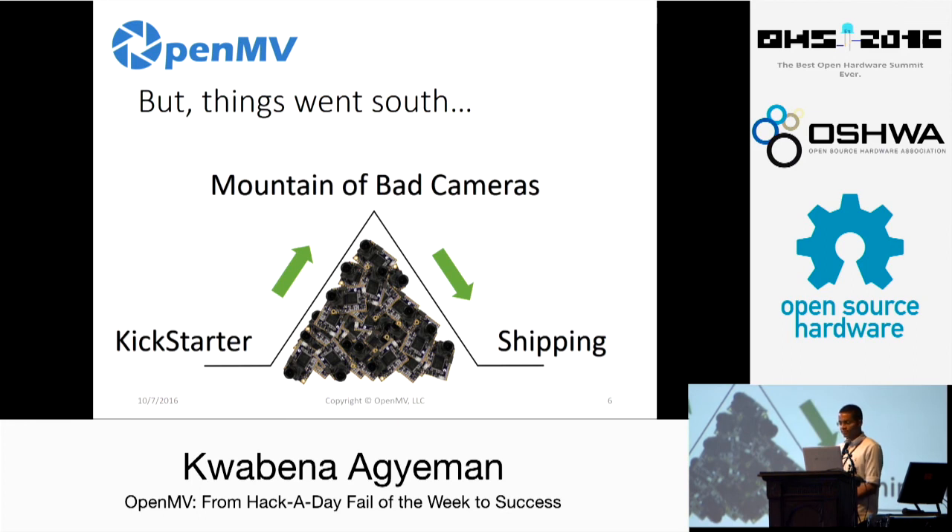But this story is about overcoming failure, and like every story arc, there needs to be some conflict and failure. In our story, we had a mountain of bad cameras. We designed the OpenMV cam with a chip called the OV2640 image sensor from OmniVision. It was a nice chip with built-in JPEG compression, meaning you get fully JPEG-compressed images on an 8-bit data bus right out of the camera. You can store it in your microcontroller's RAM and write it out to an SD card easily — you could fit the JPEG-compressed image in a few kilobytes. It was also cheap at $2. But it was a very old chip, produced back in 2006. We built a few boards by hand and there wasn't a problem, so we thought this was great.